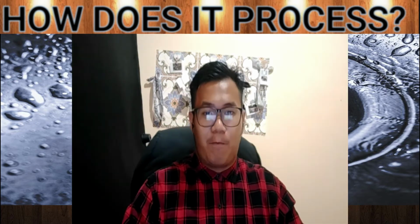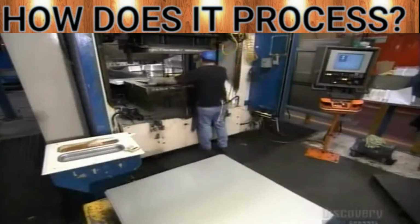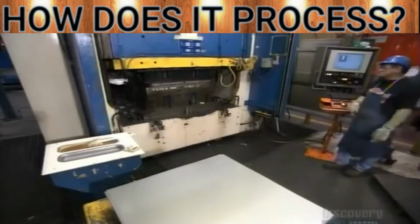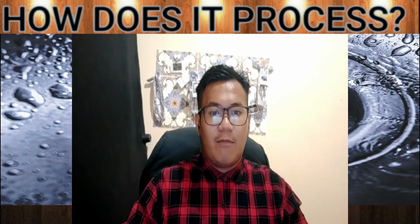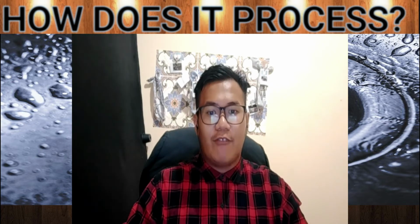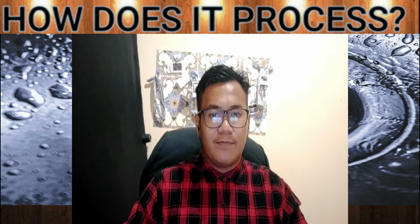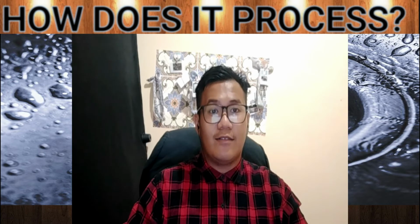The next step of drawing is the drawing itself. The first step is to place the steel plate on the press table. There are holes on the upper and lower plates of the workbench. The product mold is located within the holes of the lower plate of the table. When the motor switch is pressed, the upper plate of the hydraulic stage is lowered and the entire table comes down. During the sinking process, the horizontal position of the die remains unchanged so that the steel plate is forced upward to complete form stretching. The first drawing depth must be 80% or more of the total design depth.